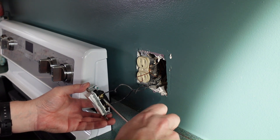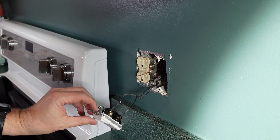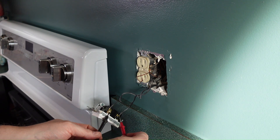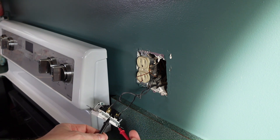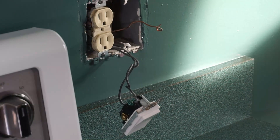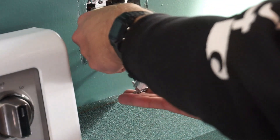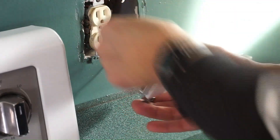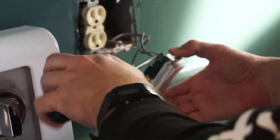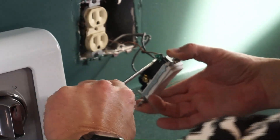Tighten that one down. Since this switch was hot, the pliers I used to strip it are electrician's pliers, so they're insulated — hence why I did not feel a poke or anything. I'm just testing it now to make sure we're good. I've had wires break before inside their black insulation, and you put everything back together and the switch or outlet doesn't work. So I always check when I put everything back together and double check that we have power. On this one we did.